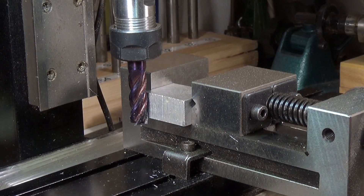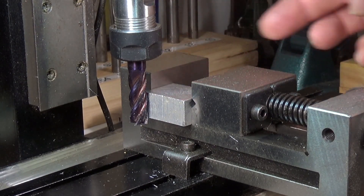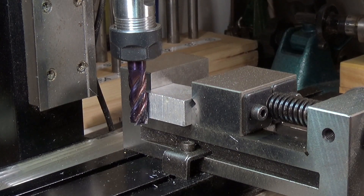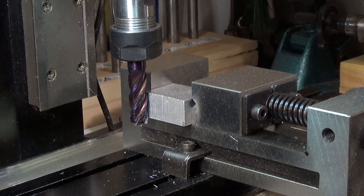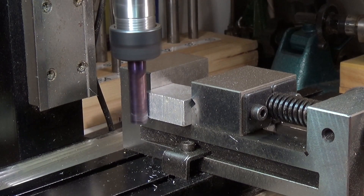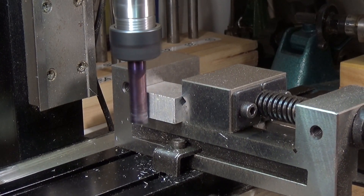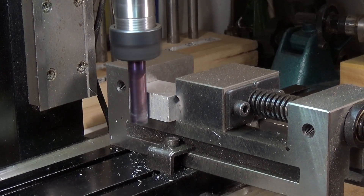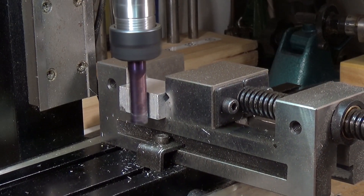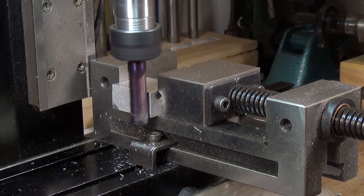Okay, so here's the setup. I'm going to start by squaring off the block. It's pretty square that way, so this doesn't have to be majorly accurate — this is not making parts for a jet engine turbine here — but I would like it to be reasonably square. So we'll flush off. I think it's widest at that far end but we'll go all the way across the face just in case. Yeah, it's clear all the way back.